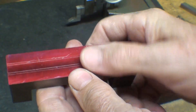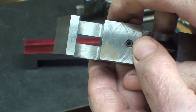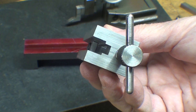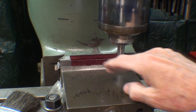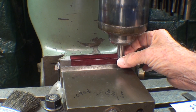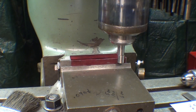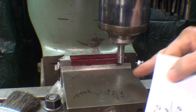Remember that the one slot goes all the way through. I'll do the 3/8ths first. The vise is set up on parallels. Here's my Starrett edge finder — that's half inch in diameter, 500 thousandths. I want to mill along the center line of this, so I want to find the center, and I'm doing that with an edge finder. Once I touch off and get the wobble out of this...